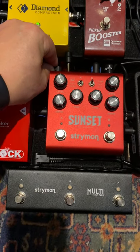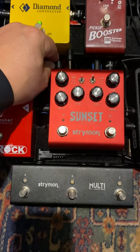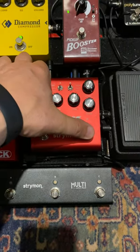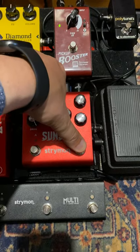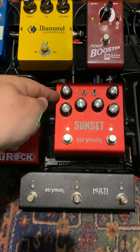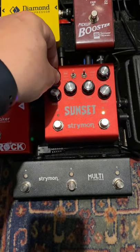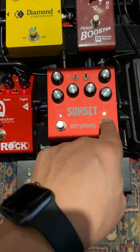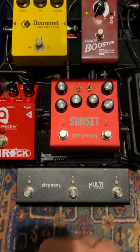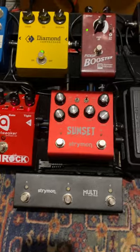Next I want to choose the MIDI channels from 4 to 12. I unplug the power and then push down the B while I power up — flashing. Then I have to turn the A level knob fully clockwise so this light will turn blue. Voilà! Push down the B to save it. Now the expression input is in MIDI mode and listening to MIDI channel 4 to 12.